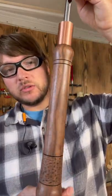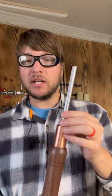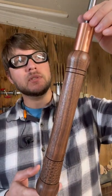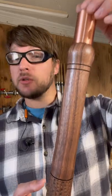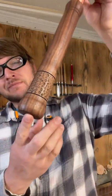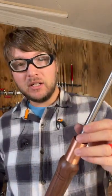I think all the tools I buy going forward will come without handles, because I think I prefer to have a custom handle. I want to invest in a larger roughing gouge. And for that, I actually want something heavy. I'm going to give myself some heavy material, and I want to make it longer, maybe even 8 inches longer than this handle, so that I can get the hand back and have some actual leverage on the piece when I'm doing my rough work.